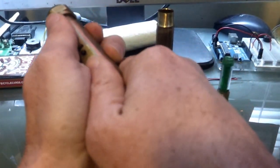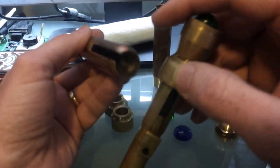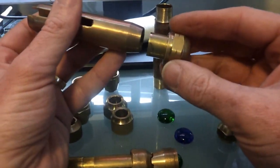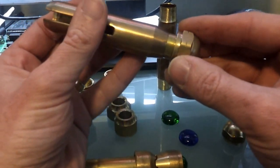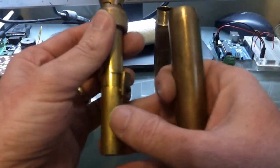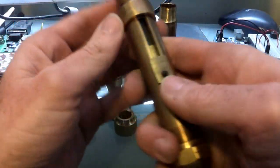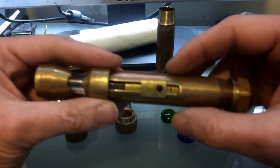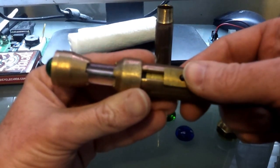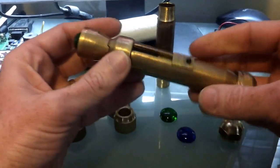Kind of the same at the top. I didn't make the internal collar — the piece that fits just inside the body tube — long enough, so it kind of hangs up. At the bottom you can see how stubby the internal sleeve is. That internal sleeve is there just so it fits tight inside the body. I didn't want to use a set screw or anything because you don't want to have screws sticking out of your sonic screwdriver. So here I'll show you the hang up — it's very, very loose right here because in this space there is no internal collar to hold it tight. And then once I get to this point, it's hitting the collar on the very top and I have to push hard to get it through. But it does everything I want it to — it opens and closes, and I found out the design will work.